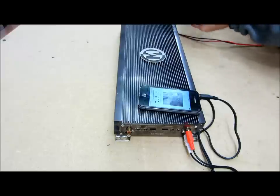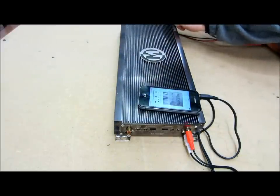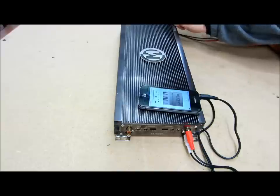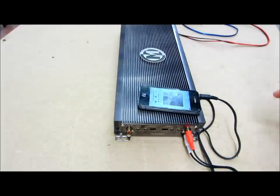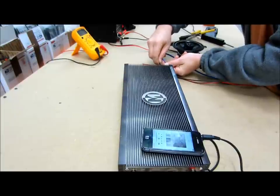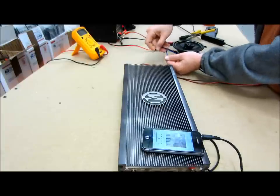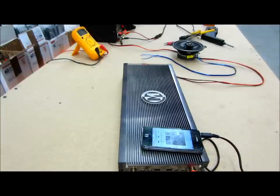I'm going to take my test speaker. There's my left, and my right. I'm going to do the bridge, which is left positive, right negative — it's marked on this amplifier, but that's pretty much standard on most amps. That gives you the summed output of both channels together. Left parallel, right parallel output — left positive and right negative. You can see that the sound was doubled when I did that, so that's all good for my rear channel.